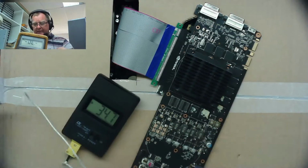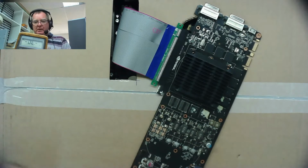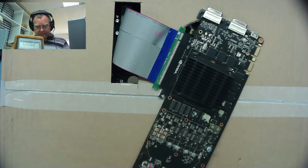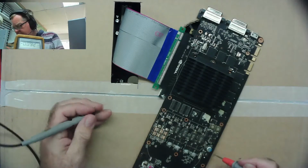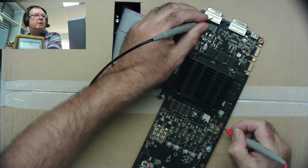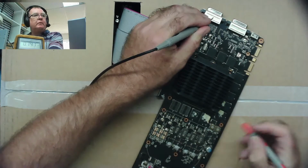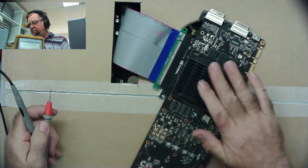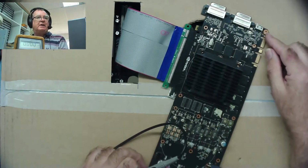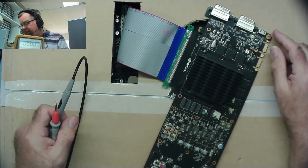As I said, we couldn't see any short. I think it's about 10 ohms anyway. All we have for certain is that the voltage here, sorry, here is unusually low. I have to say, I think it's probably the GPU. But I'm just trying to think if I can find any way we can actually prove that a little bit further. So yeah, I'll have a think about that, and let's see if we can devise some other way to prove where the problem is.